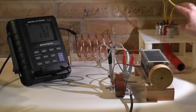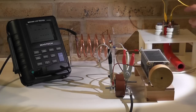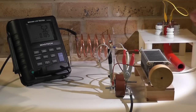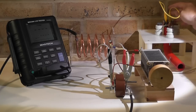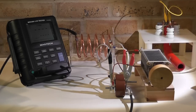My assumed 4 µH or 1.7 µH all of a sudden becomes 5.1 µH with the wire and coil together. There's another thing to bear in mind: I used this cable — a very bad choice. This cable has high resistance and makes quite a difference, so it's not accurate to do it this way. I should really connect that with a very short cable, then it would be much better. Using crocodile clips like this is a really bad choice for such a measurement system.